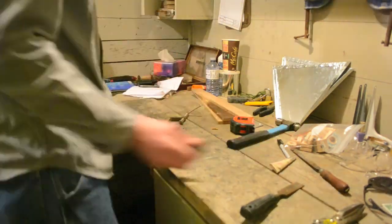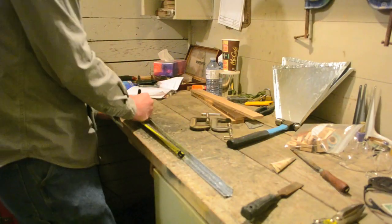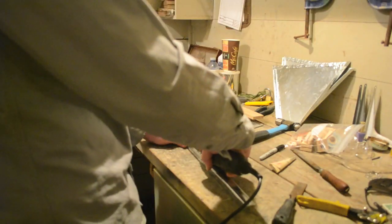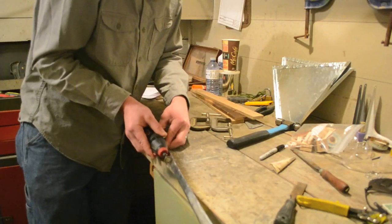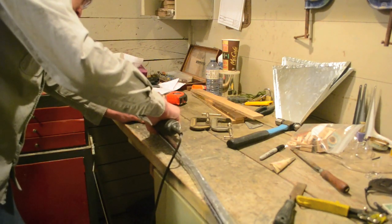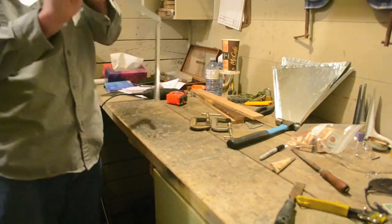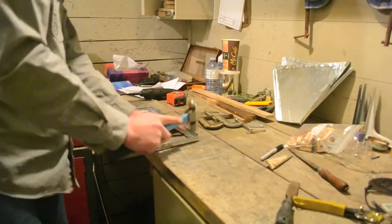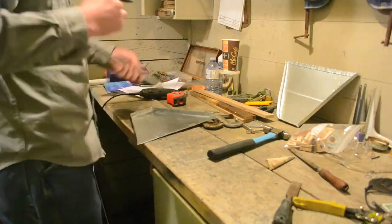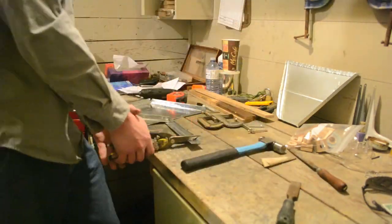Once the shelf is shaped, mark 2 lines 15 inches apart in the center of the piece on the edge with the double fold. You will cut through the double fold back to the bend. This is where the shelf will bend 90 degrees to turn in the corners. Using the sides, mark where you need to cut off the shelf support and cut your pieces to their finished length.